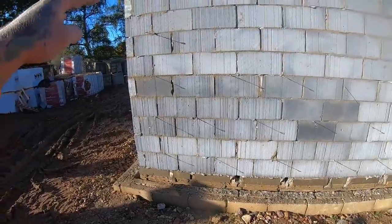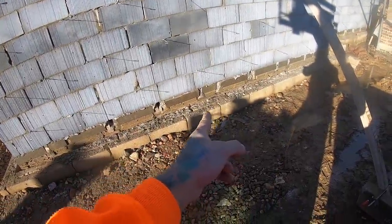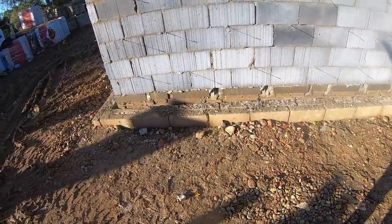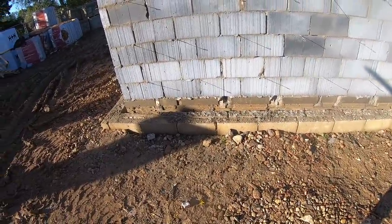To get a full height corner, you want to go about 12 bricks out, which is 2, 4, 6, 8, 10, 12, which is about halfway. Because it's Flemish bond, I might put a few tooths in it, and I'll make it look like a Christmas tree as it's Christmas.